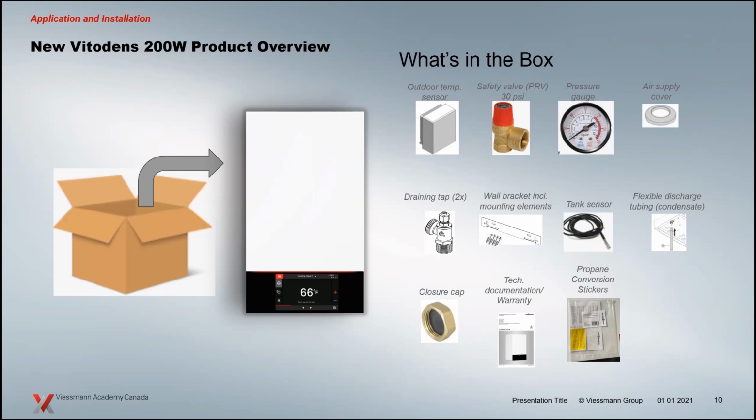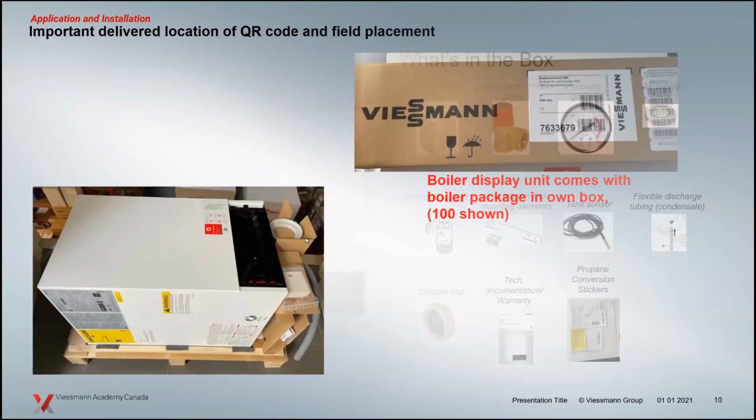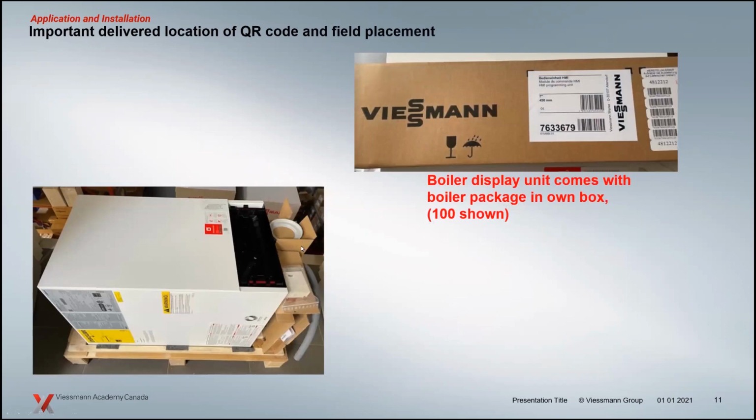Your technical documentation, always important, but now hard copies are available. They come with every boiler, but if you have the Vito Guide apps and all those apps we talk about, these are all electronic as well. And electronic is actually better with documentation because it's living, which means that when there are changes to that documentation, you're going to get the most up-to-date manual if you use the electronic copies. Then we have the closure caps, something new in our boiler trim kits. If you don't have domestic hot water in your system, you have these caps. You can just thread those on because we have that 4-pipe design now to isolate those connections. We don't need a bypass or anything else in those connections. Just cap them and leave them.